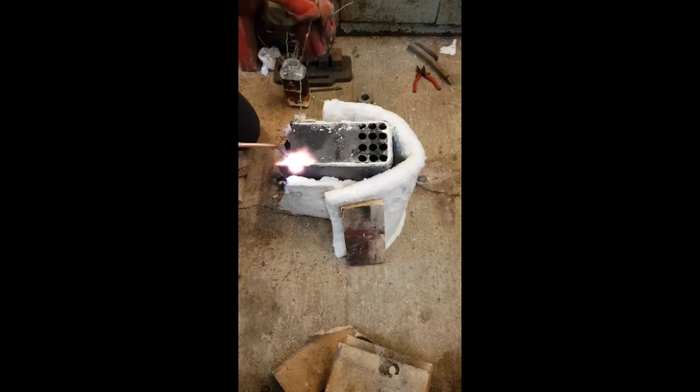I'm using oxypropane as the heat source. Unlike oxycetylene which burns at near 3,500 degrees, oxypropane burns at around 2,800. But the central cone is sort of long and fat and doesn't have a nice sharp tip at the end. I think this must be an advantage in hard soldering as it gives a larger heating area and thus more heat control.